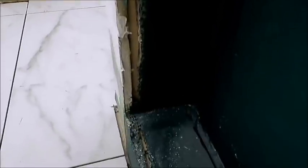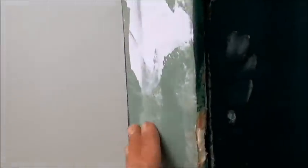They really hacked up this wall board badly. Mud could take up the difference, but why? That's not even a good score-and-snap cut - that should have been cut with a saw outside and then transitioned to sheetrock.